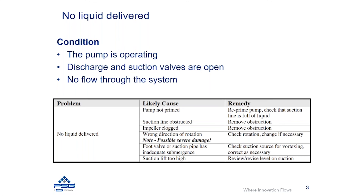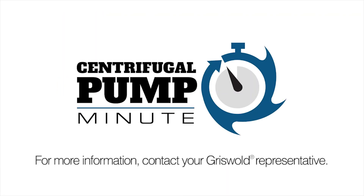Finally, even if your pump is primed and you have the right suction conditions, you may have too significant of a suction lift. If that's occurring, you need to look at your design and consider adjustments. Pumps have a limited ability to lift fluid into the pump, so excessive suction lift may need to be addressed at the design level.